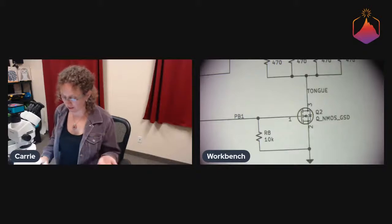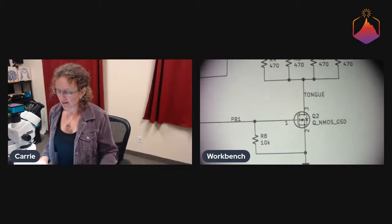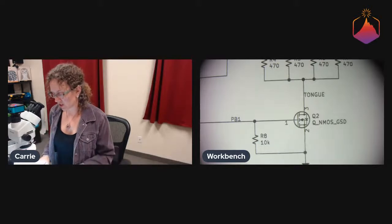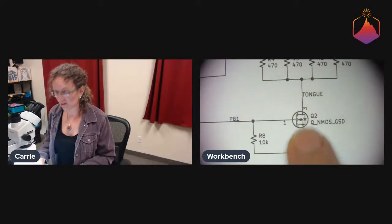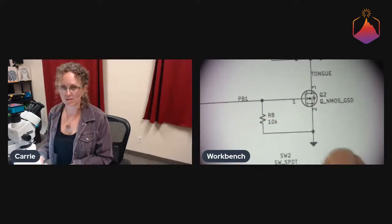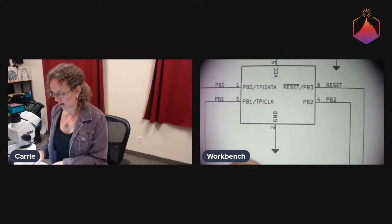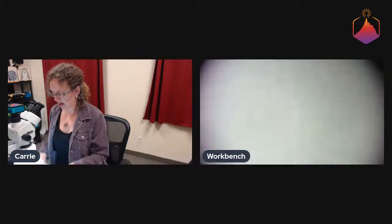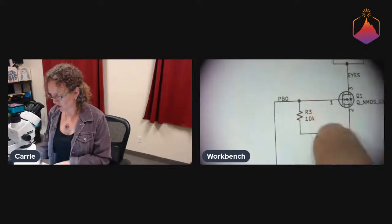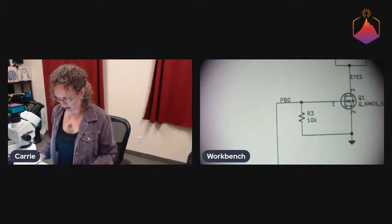So yeah, there was a little bit of learning there, this was kind of different from the breadboard circuit. Not super surprising. Breadboards have way different characteristics, more resistance, more capacitance too, actually, but it was solvable with just different FETs. Cool. The other thing still related to that was that the TPI data line was the most picky, this guy, and so it was not happy with the 10K resistor pull down, so we changed both of these to 100K. So these are now 100K. The FETs are just slightly different.